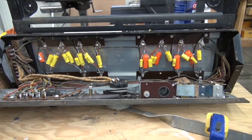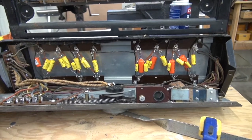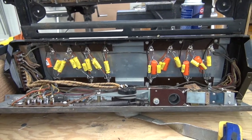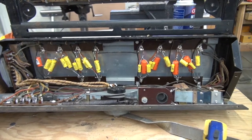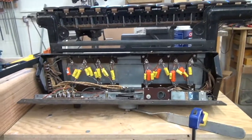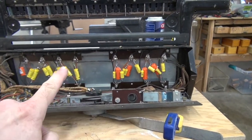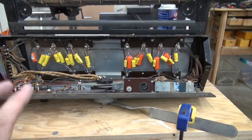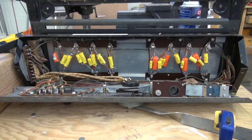I just figured it was in reverse — that as you went lower, the capacitors would be stacked up in parallel — but it's the opposite. The original capacitors were way out of spec, and the tuning was terrible. I tried putting them back with values very close to the same, but it just didn't work very well. I found that this thing was never in tune from the factory, because each individual capacitor has to have a different value to produce an equal-tempered scale. As the factory had it set up, there were two places with identical values, so the spacing between notes couldn't have been right.